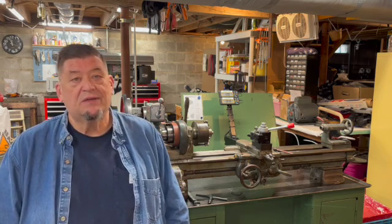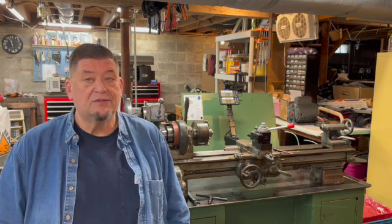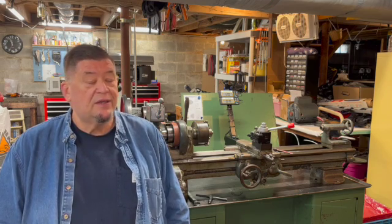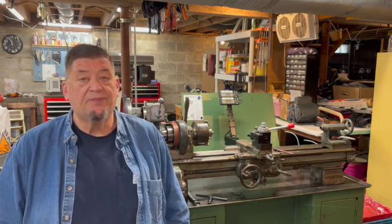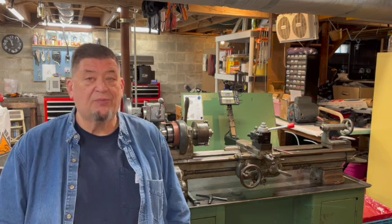So I started looking at my machine, took it apart, studied what I had, looked at what was available for DROs, and I ended up buying the iGaging DROs which I found on Amazon and only spent $132 for the CrossFeed and the carriage altogether. The brackets and fasteners and everything else I had scrap on hand that I fabricated it out of.